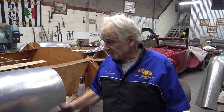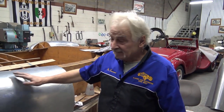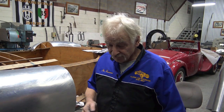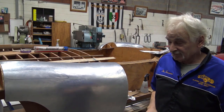The camera tells me I'm running out of batteries, so we might have to leave it here. I hope you enjoy it. It's just a quickie, as I said, just to show you mainly how you wheel. Keep in mind that if you're doing a Jaguar mudguard or an Austin Healey, that drop is the same process. You just have to stretch the edge and round it off. And of course, the Austin Healey, instead of coming up like that, it really comes up. But the principle is the same.